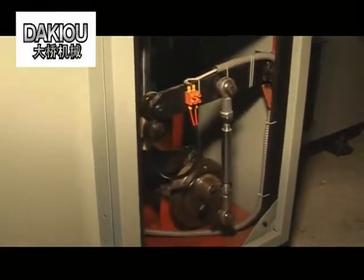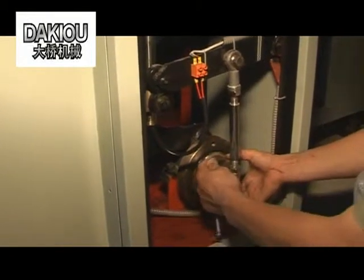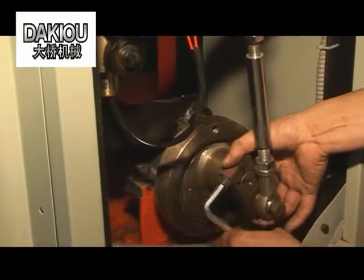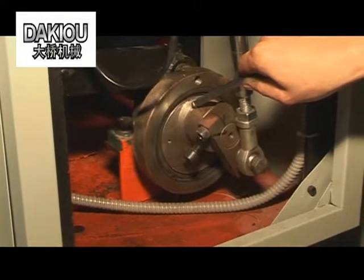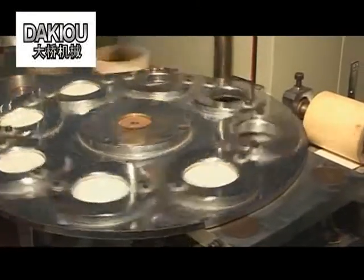If the cutting roller die does not cut the paper entirely, and the lifting axis ejects the cup bottom, in this case, slightly turn the lift axis counterclockwise, or turn the eccentric wheel clockwise slightly. Note, observe when the bottom paper stops, and choose one to adjust. Another cause might be the overwear of the lower and upper die. In this case, sharpen the scraper or change it with new ones.